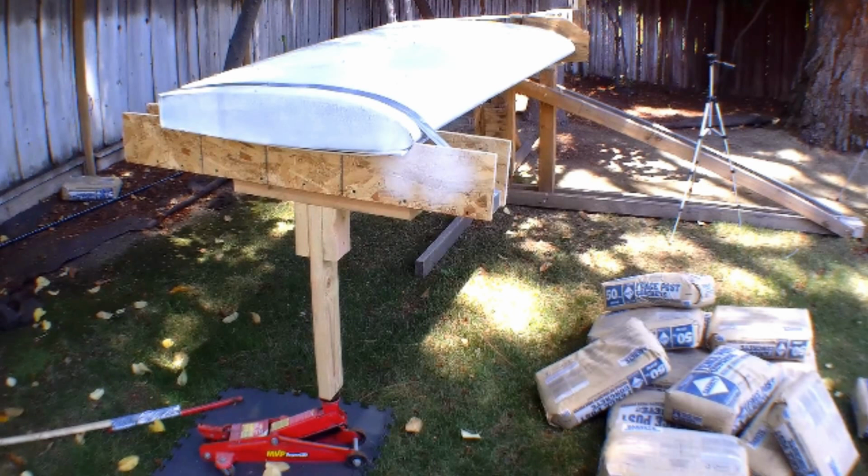So basically we get the bags loaded up there, and I release the jack stand until the jack disengages from that T-shaped post, and that's when the wing is taking the load. The number of bags used and their location on the wing is determined in advance based on the projected loading of the wing at various G loads. Because the wing is not full span, we have to load the bags inboard, which means that we have to actually apply more weight than the wing would endure in a loaded condition in flight in order to get the appropriate bending at the root, because we don't have the full moment arm.